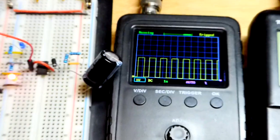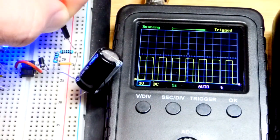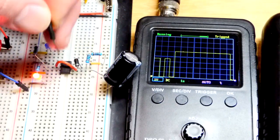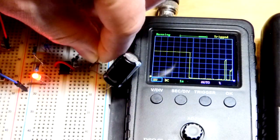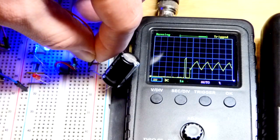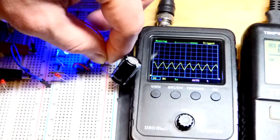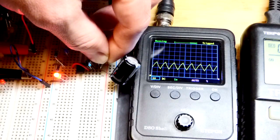We have just shy of the supply voltage — it looks like somewhere around 3.5 volts. Moving the red jumper to the positive supply shows it is 5 volts. Most importantly for this video is the capacitor waveform: the capacitor is charging while the red LED is lit (high output) and discharging when the blue LED is lit (low output), as you can see right there.